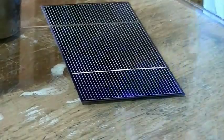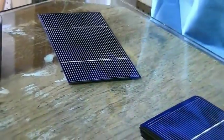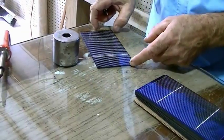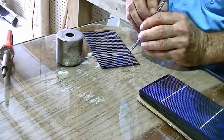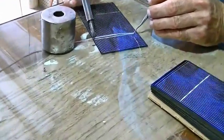You can't immediately go and solder the other side. You've got to give the soldering iron a chance to reheat that tip — that's also critical. By the time you get your next cell in position, take your time, don't get in a rush. Hold it down again and re-solder.